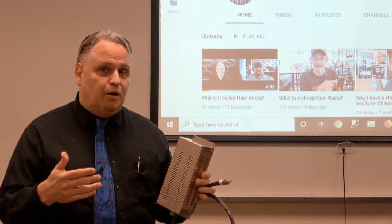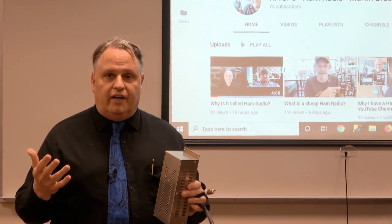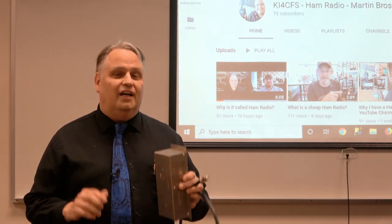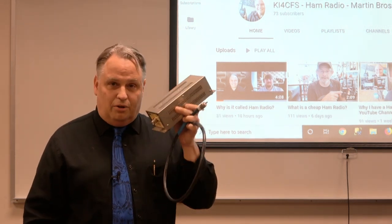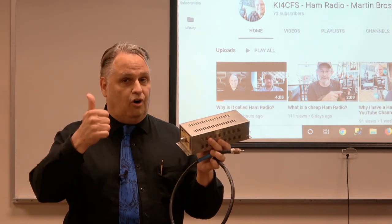I want to give a quick example of how I've used it. Getting back into ham radio, I noticed I have an SWR meter in line with my two meter 440 and it had a high SWR, which isn't really good. So I had it on low power and I realized I need to solve this problem. Alan, one of the local hams, said you need to get your dummy load out and start breaking down all the pathways from the radio out and find out where the SWR goes up.